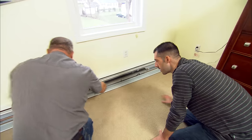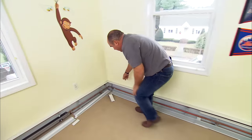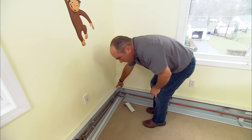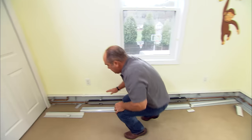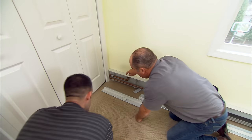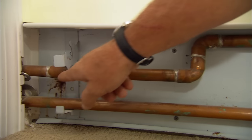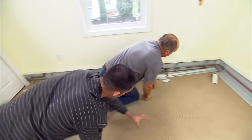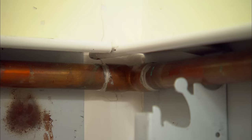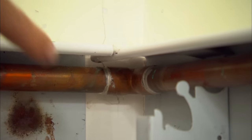The pump is pushing the water along here. There's no fins right here, and then it comes to here and that pipe turns — there's plenty of room for expansion. A little more heating element right here. Here's that supply line that continues into the next bedroom, but instead of going right back to the boiler, it actually returns and turns back this way. See this pipe tucked way up in here? It comes to this corner. If you feel in here, this pipe is actually so long that it's pushing against the outside wall — it's actually cracked the wall right there.